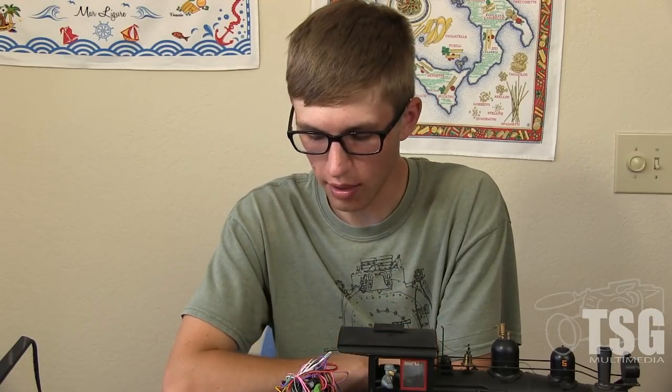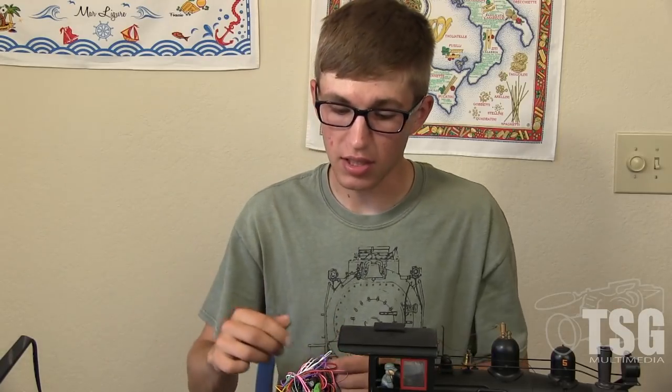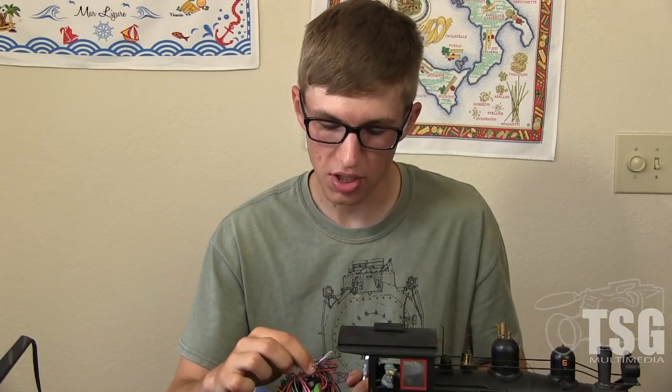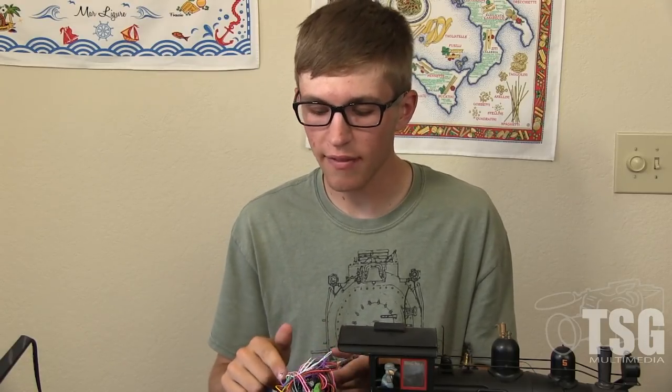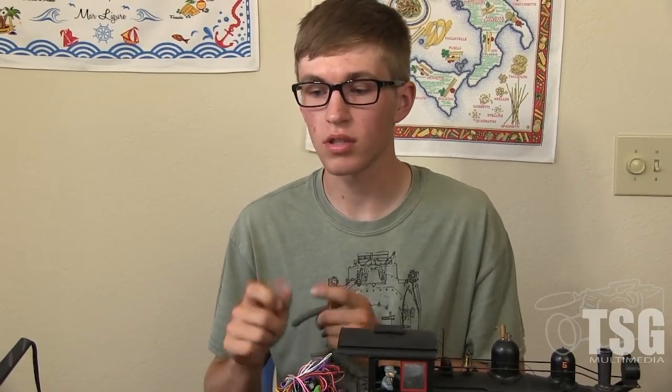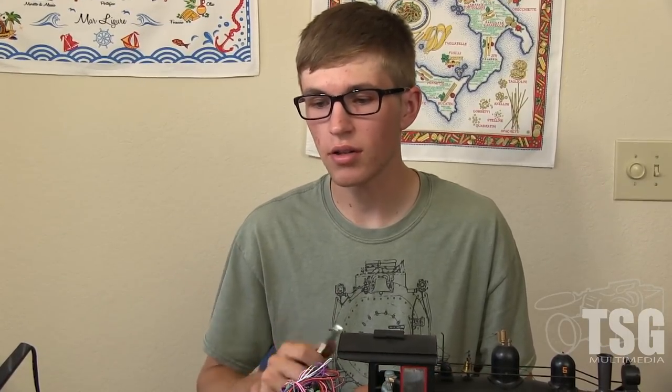Makes sense. So the next step is to start using our wire clippers, and some of these are screw terminals, so for those, you just unscrew the little terminal, take the wire out and tin it, put it in the Tsunami decoder. But a lot of these are soldered directly to the light board, so we'll clip those, strip them, and then tin it. You basically just have to know how to read the board labels. It's pretty straightforward, and you can find wiring diagrams online for these.